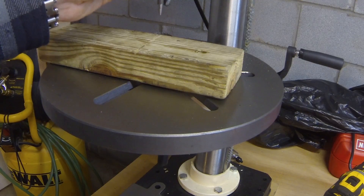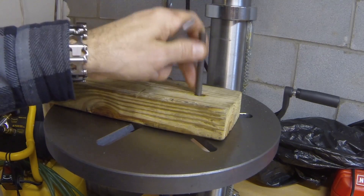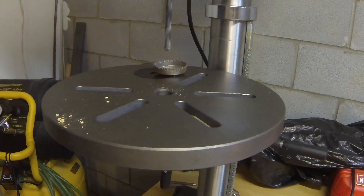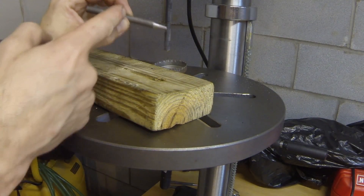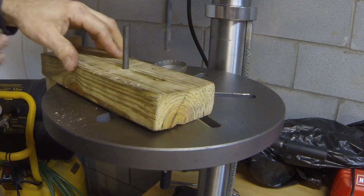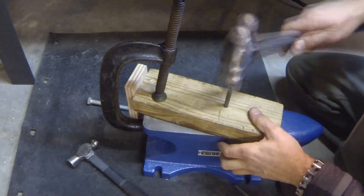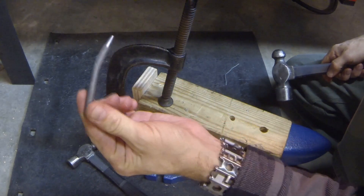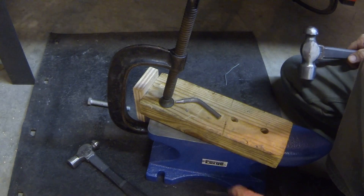So I've got my five-inch, five-sixteenths-inch drill bit in the press and I'm going to put a hole in just a little bit deep so I can pound it down and get it to the same angle, so they're all about the same. That's going to be the straight part and that'll be the bent part. See where I'm going with this? I'm just going to try to pound it down — that's going to go in all the way through till it hits the anvil. See, that's going to give me a nice bend. I think that's going to be all right.